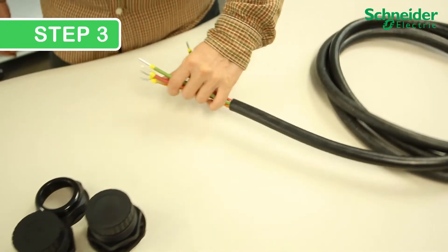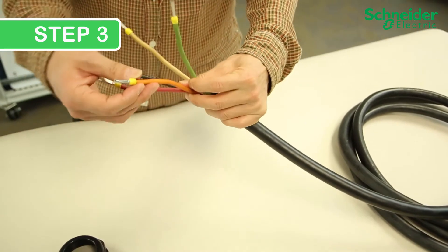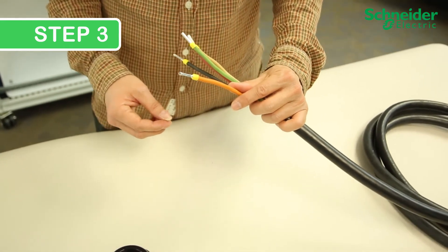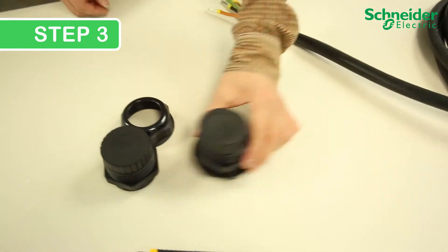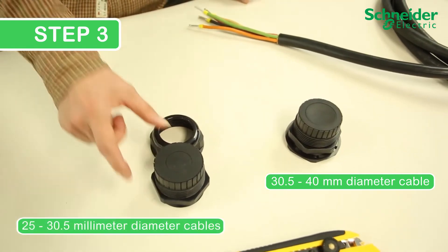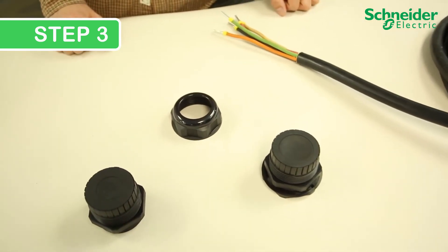Step 3. Installing AC conductors. In the CL60E, the AC cable is a 5 conductor cable with 3 lines, one neutral, and one ground. Ferrules should be used for stranded wire. With the CL60 come two AC glands: one pre-installed for 30.5 to 40 mm diameter cables, and a second size included with the accessories for smaller 25 to 30.5 mm cables. A single sealing ring to clinch the gland is included and is to be used with both AC glands.